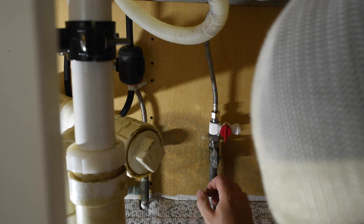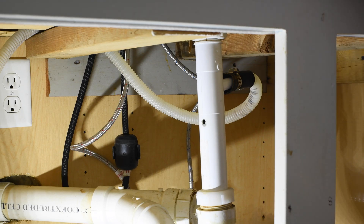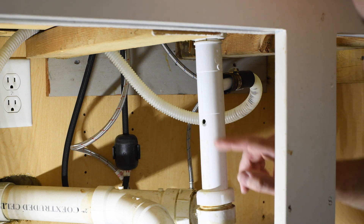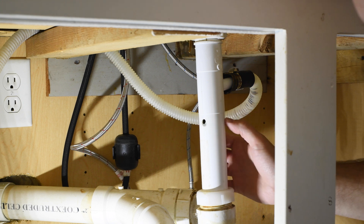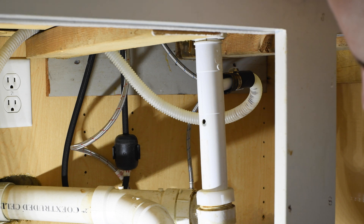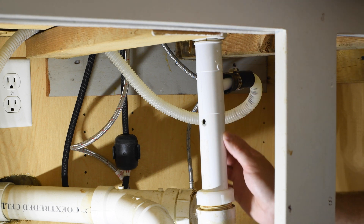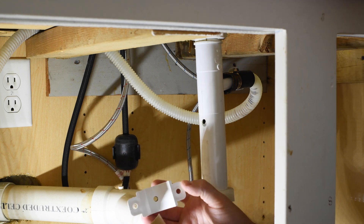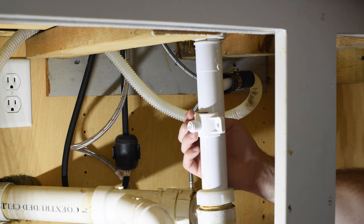So now it's time to install the drain saddle. The way the drain saddle works is basically it lets you tap into your drain pipe, and then the waste tube from the RO system connects to this and it will go straight into your drain pipe. I already had a system installed here previously, so I already have the hole in place. Now if you need to drill your hole, you need to use a quarter inch drill bit and drill that hole into a section of drain pipe that is above the trap and in a section that basically is not going to hold water long term. Inside the instructions in the manual, they go over some different scenarios. Take one half of the drain saddle and that is going to fit right over the hole in your drain pipe.